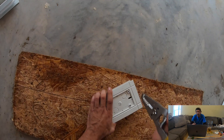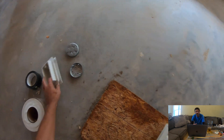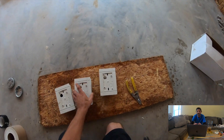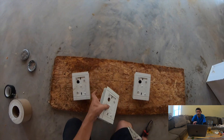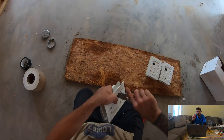I'm starting out with these Arlington boxes — this is what I'm going to be using for receptacles outside. You can use them for some other things, but mainly it's just for the receptacles: front porch, back porch, and near the AC unit. Taking out the half-inch knockouts and I'm going to ream them out so my half-inch grommet goes in there nice and easy, because a lot of times there's a little bit of chunk in there.